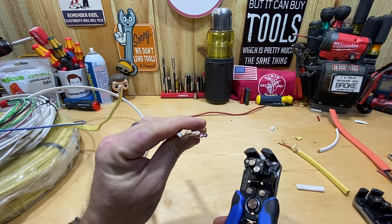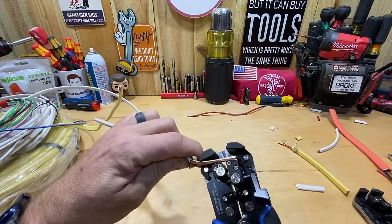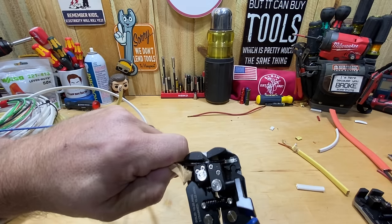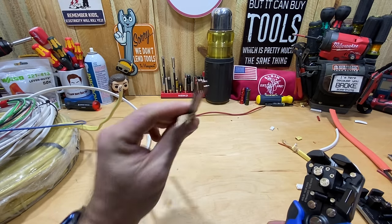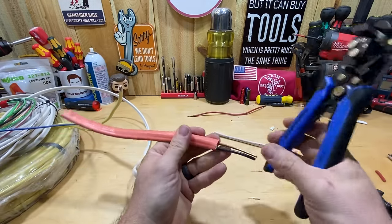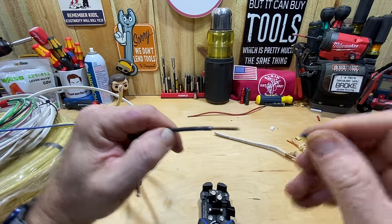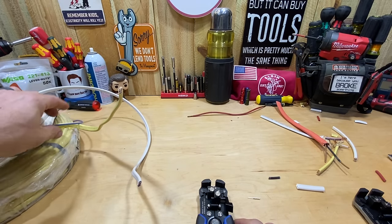The paper doesn't always come off cleanly on 14 gauge — sometimes it will on 12 gauge. With 14/3, if I put all the wires in with the ground on the outside, I'm going to see if I can strip all of them at once. It doesn't look like the 14/3 works perfectly here either, but if you get it just right you can do it — it just doesn't want to cooperate easily, probably because you're near the outside edge. It did strip all three 14/3 wires at once, just not super easy. With 10 gauge solid — the maximum it claims — no issue at all.